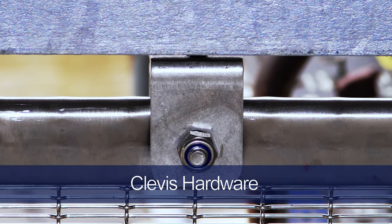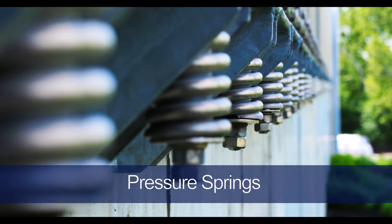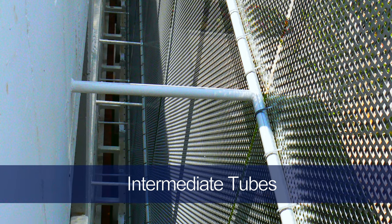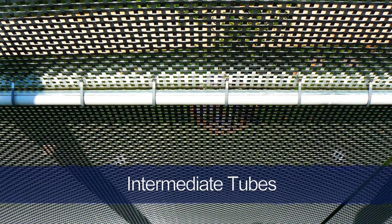The clevis hardware are brackets placed along the top and bottom flat tension profile clamps, connecting the mesh panels to the substructure frame. The pressure springs are located at the bottom substructural frame and provide a safe means of tensioning the mesh — as wind hits the panels, the springs provide enough give to maintain aesthetic qualities without damage. Lastly, the intermediate tubes are designed to provide additional support throughout the length of the facade, preventing panels from drifting and being damaged.